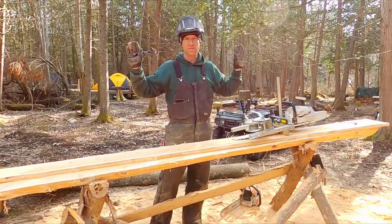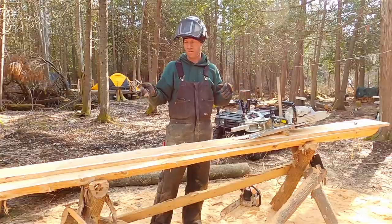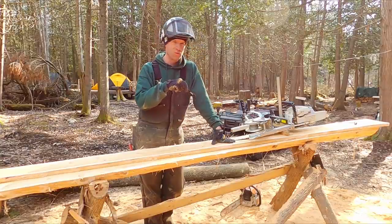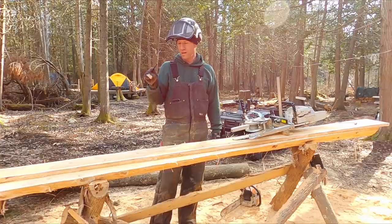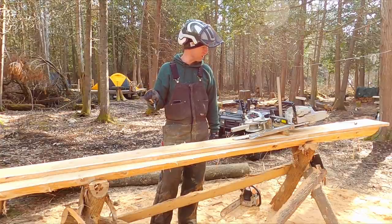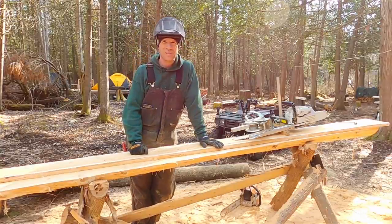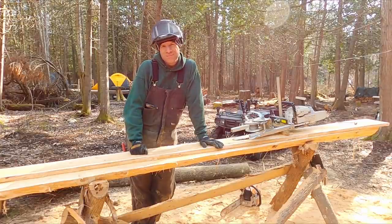This is just my opinion — you do get a lot more life out of milling with semi-chisel chains. The cut clearly isn't as pretty. The Granberg chains I like so much are around $35-40 each, where that Archer chain that looked pretty rough on the milling cut was like $18. The fancy milling chain does seem to give the rippliest cut — it doesn't grab or chew up the wood, but you do see lumps and bumps. However, for me, the fact that I can cut in some cases 50 to 100 percent more board feet before sharpening makes it kind of no contest.